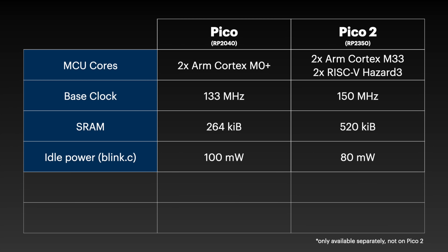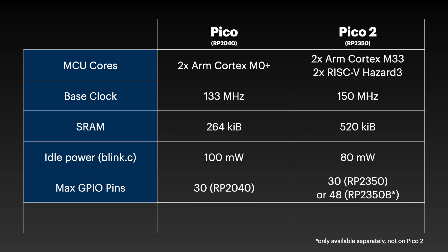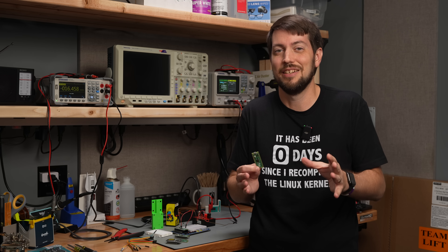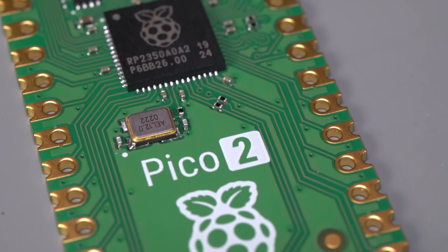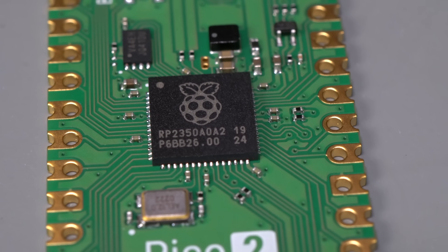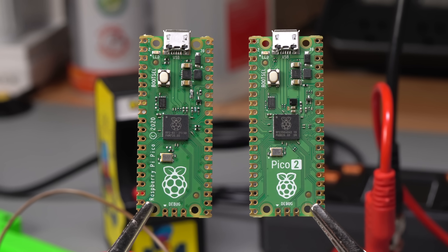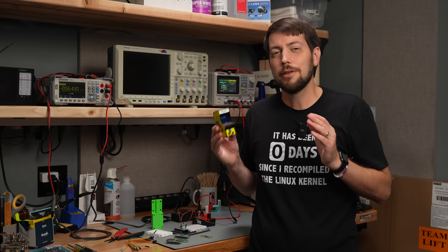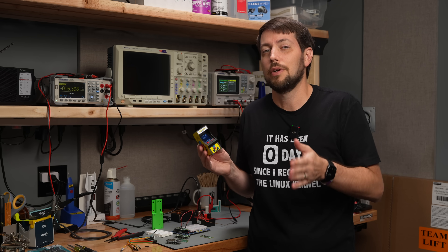The Pico consumed around 100mW at idle, and the Pico 2 only about 80. The RP2040 came in one package size with four ADCs and 30 total GPIO pins. The RP2350 comes in two package sizes, and the bigger one has 48 GPIO pins. There are also a lot of new things like built-in flash options and OTP storage. Raspberry Pi has improved every aspect of their first chip, and having the same form factor is huge — if you had something that used a Pico, you can just swap in a Pico 2 once the software's updated for a quick upgrade.